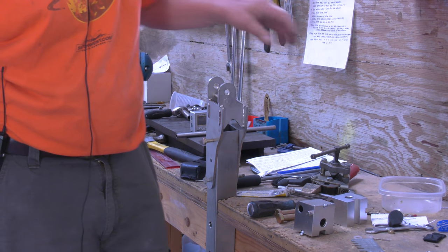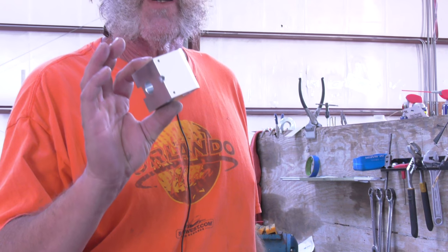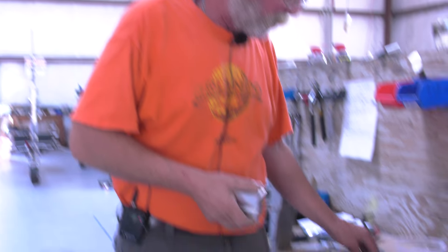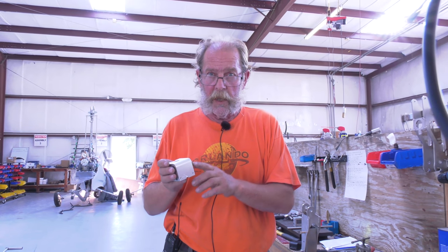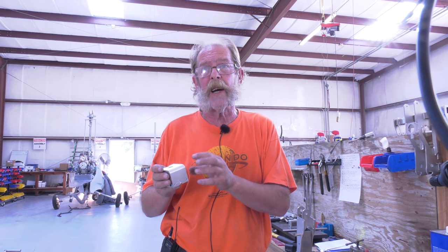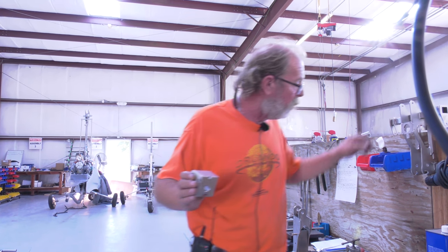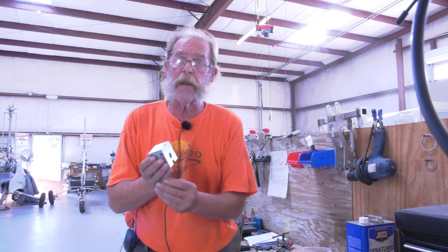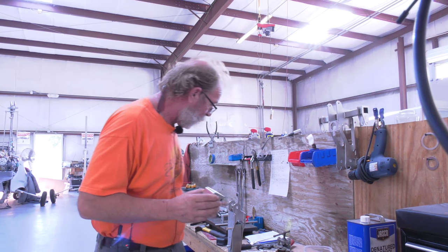The next thing that goes on here is our rolling pitch block. That's how we get it delivered from the manufacturer. We use oil-lite bushings here — sinter brass with all kinds of lubricants inside. This is where the bolt goes through. It also gets lubricated through little grease fittings that go in here later on. For service, this is where you lubricate the pins that go through here.